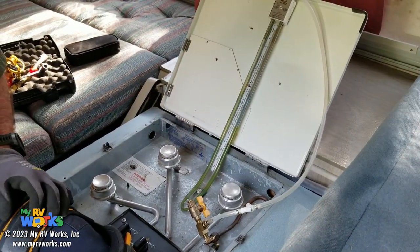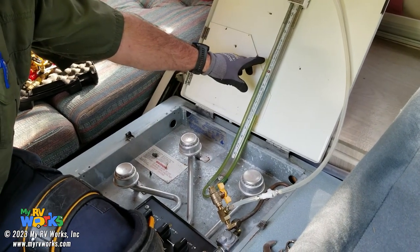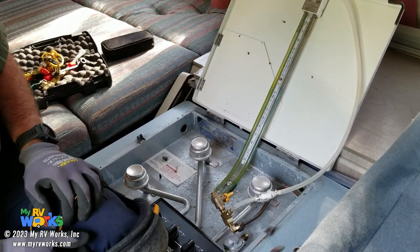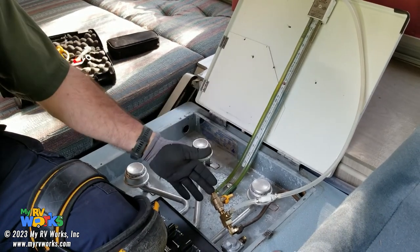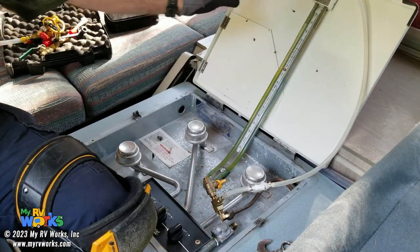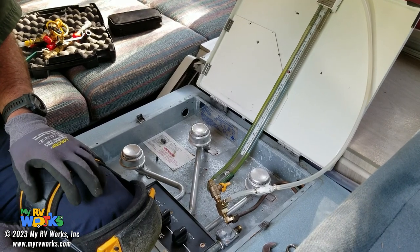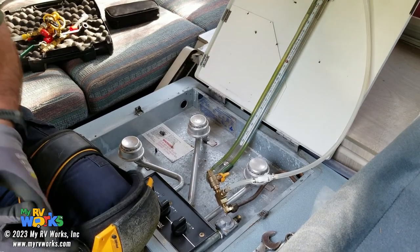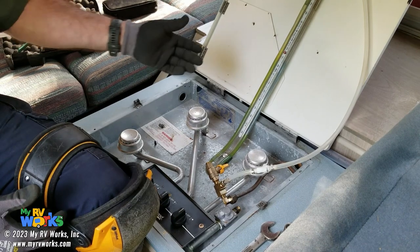So when I do my 50% load, I'm at like 3.2 and 3, that's going to be 6.2. That's too low. So there may be oil in the line. I don't know. But again, that's me saying that if this was a true 50% load test. But the fact that this thing's going off the scale, that's an automatic fail. The most this thing is allowed to go is 15 inches of water column, which is going to be 7.5, 7.5, and we're over that. So that's an automatic fail. We already know that we need to replace the regulator anyway, so this doesn't surprise me.